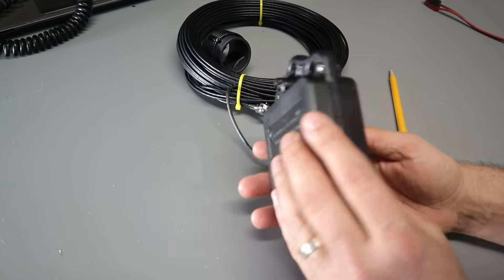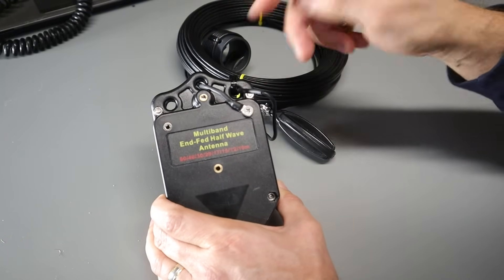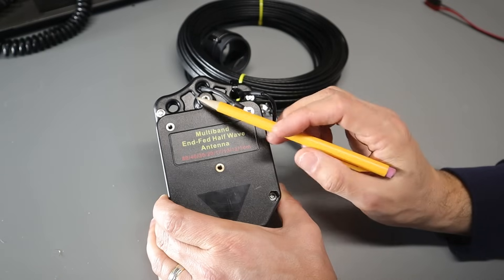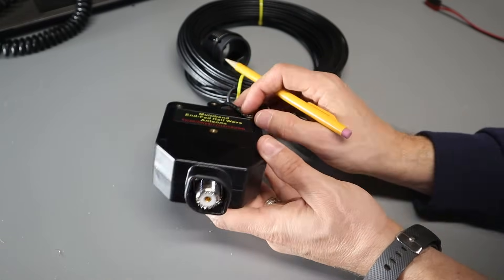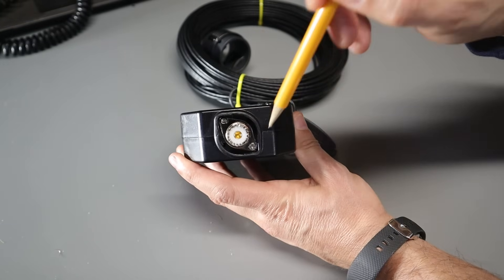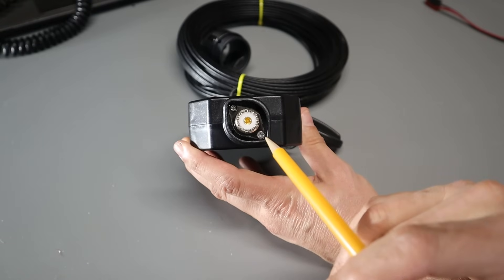Here's the 64-to-1 Unun. You can see it's in a pretty heavy duty weatherproof case. Starting at the top, this free hole is used for our anchor rope, and then these other two are consumed with the radiating wire and act as a strain relief. You can see the wire loops through and it's even zip tied up here. The radiating wire attaches right here to this threaded insert on the right side. There are three more threaded inserts here but I don't believe they connect to anything. Down at the bottom we have our SO239 connector. One of the fasteners that holds it on is an Allen head screw and the other one is a Phillips. This Phillips head screw is intended to be used to connect up your counterpoise wire should you choose to use one.